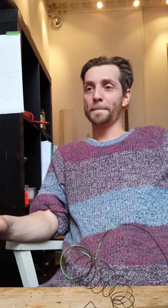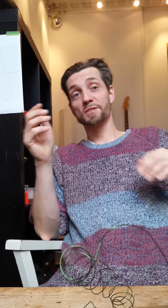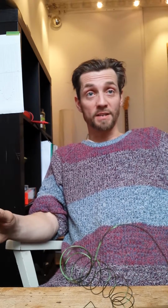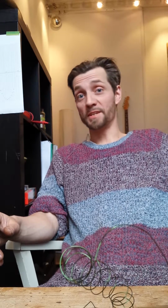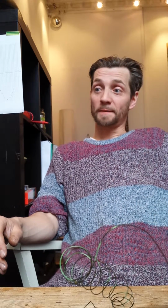Now what I'm thinking about doing is to make a larger secondary, so we get a higher voltage, and then to see where the capacitors eventually break down. This steel capacitor is sometimes arcing over between the plates, meaning that the distance between the plates is a little bit too small. So the distance must be increased, and or the change of dielectric. So I have to use some other material instead of air. I'll look more into that.